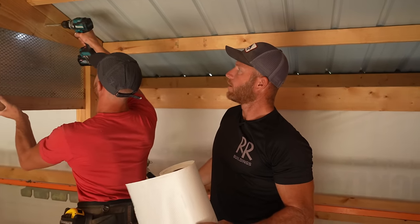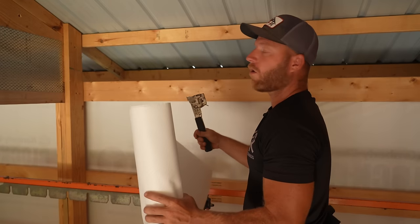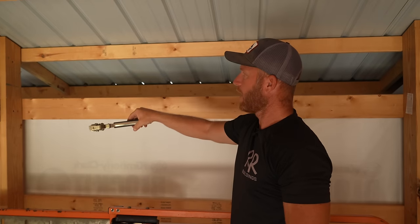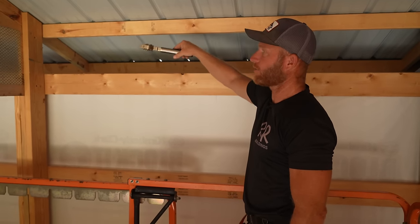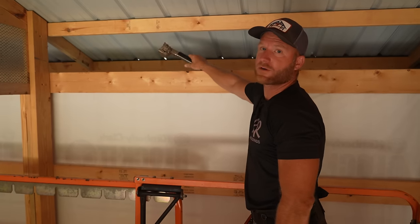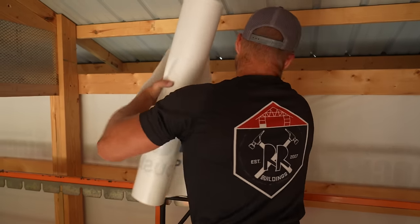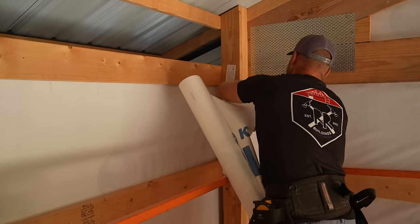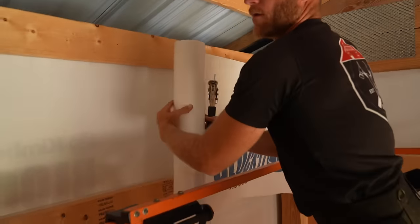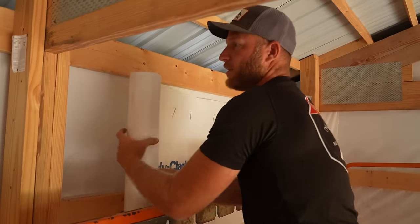There's a lot of complaining going on. When we put a ceiling in and you go to insulate, we want to get a good R-38 insulation all the way out to the outside wall, but we don't want blown-in insulation going into our soffit. So we're making our own custom attic air deflector — pretty sweet as far as attic air deflectors go. I'm just running this the length of the building and then we'll cut it to fit as we install them.